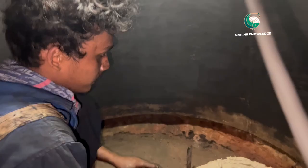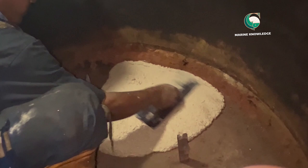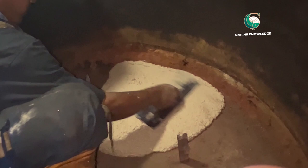Once we are done, we get inside the boiler furnace area and start applying it. The main thing is you should not give the top surface a polished finish — it should always be a grained surface. We keep applying the refractory material, covering the entire anchor bolt area, and fill the refractories 15 centimeters below the drain pipe.